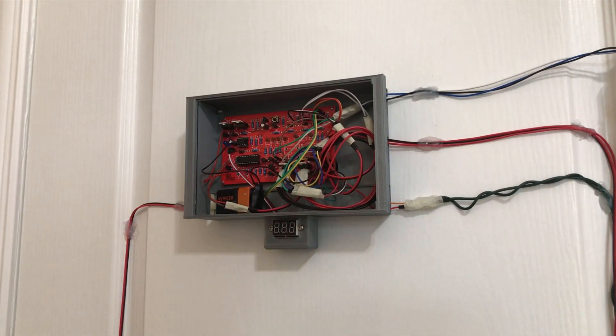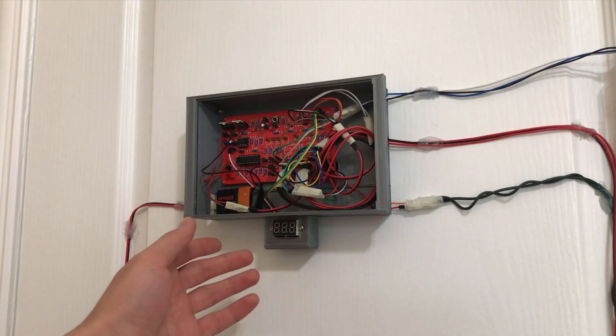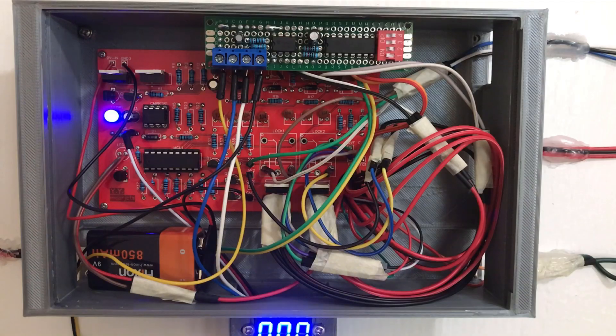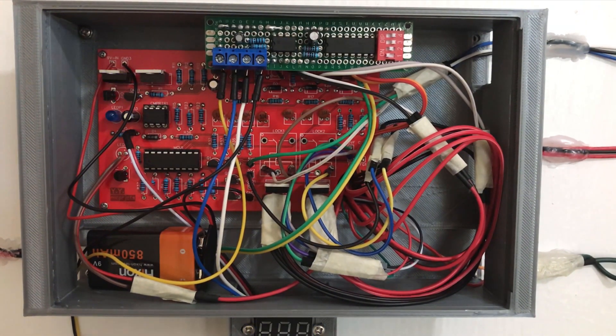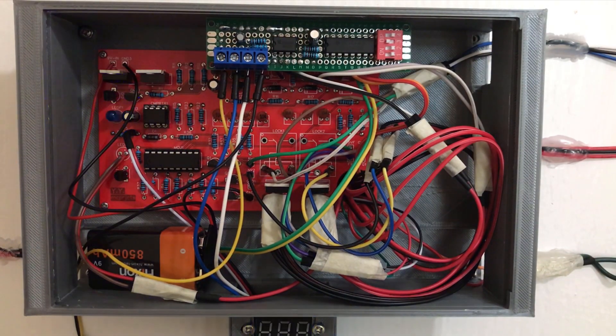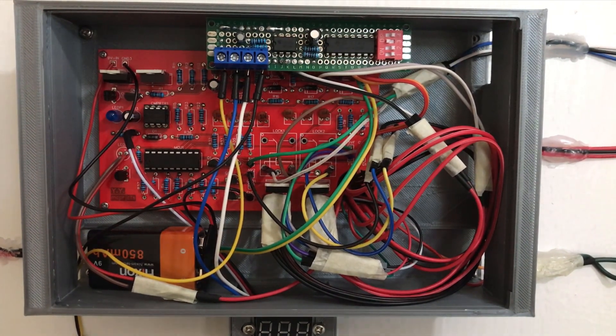I have a fingerprint lock for my door. Once turned on, the fingerprint sensor waits for a finger and then checks if it is mine or not. But what if someone presses the button and doesn't present a finger? The circuit will wait for a fingerprint until the battery runs out. So I can quickly attach this watchdog timer and pick how long I want the delay to be for the door lock circuit to turn off once turned on. Here's the maximum delay, and here's the shorter delay. This way, I can know that the circuit won't run out of battery by accident and I won't be locked outside of my room.